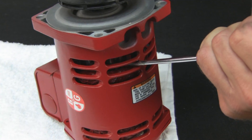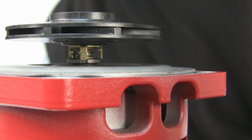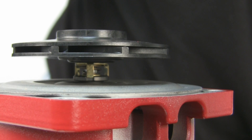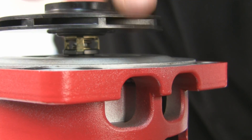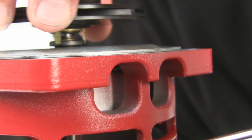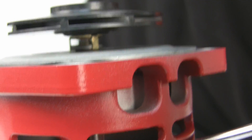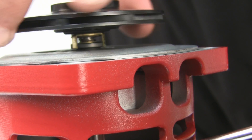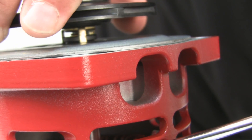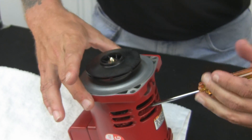You can see the brass ears over the top of the carbon. You have to make sure that those brass ears stay in those grooves while you're tightening the impeller — if they come out, it's not going to spin properly and it'll probably leak on you. But if you notice, the tabs are partially on the carbon and aligned, so I can keep tightening the impeller. The motor locked for me. And if you notice, as I'm screwing the impeller on, the brass collar is carrying the carbon around in a circle, which means it's locked in place. My impeller is tight — just give it a little tweak. You don't want to over-tighten it. A little tedious, not terrible.